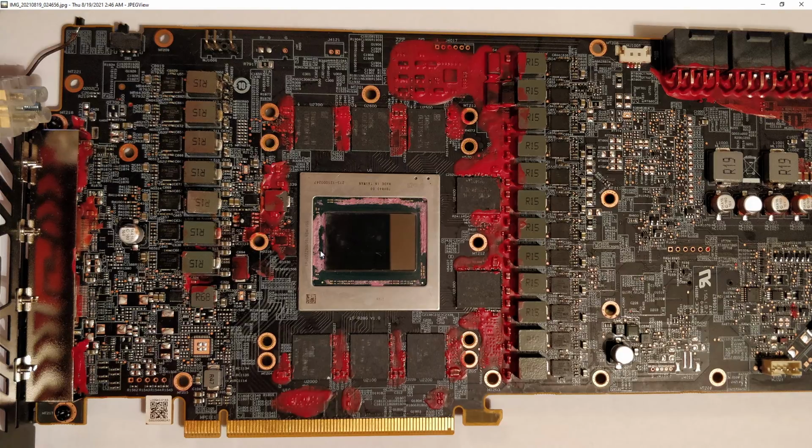And then if we factor in the fact that I had a voltage offset on this card, which was pretty high, I think when it failed this was on plus 300 millivolts. So, booting the VRM from 0 to 0.9 volts or 0.7 volts, I can't remember what it normally boots up to initially. When you do a full system power down and restart, it powers up to 0.9 volts. But when it's in Windows, the driver is managing the VRM very directly, and so I assume it's a different voltage.